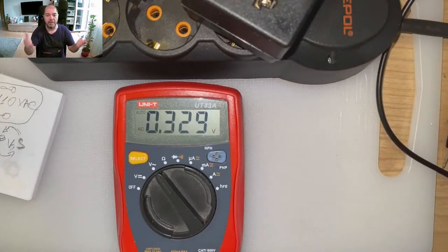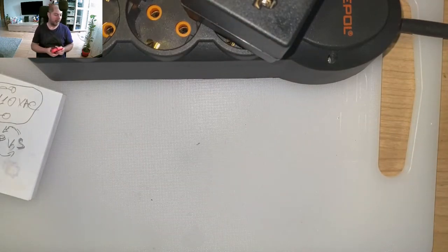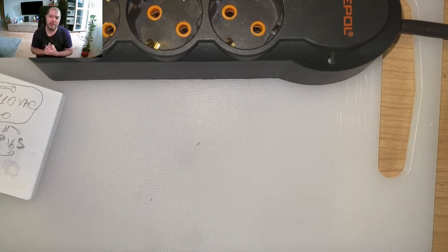Okay, it's a bad device. If I plug it into the tape deck that I want to use with it, it should draw a lot of current. It's transistor based. Maybe I will blow some transistors inside. Maybe I will blow the filament of the VFD that it will run twice the voltage almost. Yeah, put it in as you take it out of the box and you will have a surprise, especially if the products come from China. Don't get me wrong, Chinese people do a lot of good things, but I find that the sellers and the shops who import stuff for us to have them on stock here easier to access, they get the crappiest stuff and they sell it for the highest price they can.